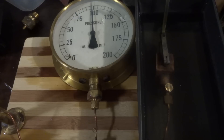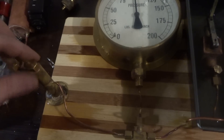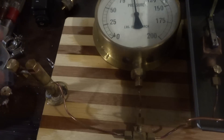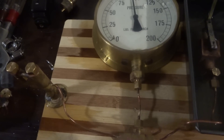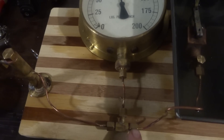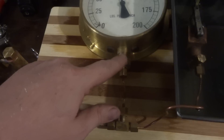What I've done is finish this test rig, so it hasn't been completely unproductive. We've got a little tower with a fitting in the top to test the pressure gauge, and a fitting here to screw the boiler into. We've finished this boiler and things are all ready to go. We've got a $2 cake tin and a $2 bamboo chopping board from the cheap shop, made up a tee with quarter 40 model engineer threads and nipples and nuts, and a fitting for the pressure gauge.